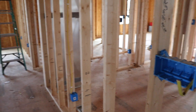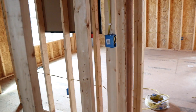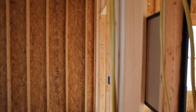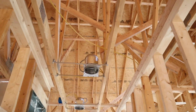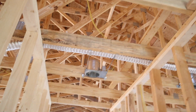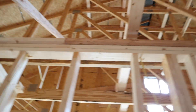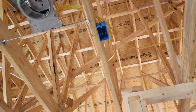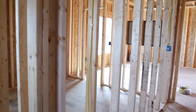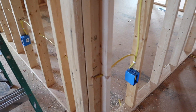I'm going to give you a quick walkthrough of the hallway. I've got a box where the power is coming in, then a 3-wire runs up and over to the other switch, which then goes up to the recessed lighting. It daisy-chains through the lights across the hallway. I also put a box for the smoke detector — it gets 12-3 wire because all the smoke detectors need to be wired together per code. And I've got my hallway outlet hopped off the nearby bedroom. That's all there is to wiring a hallway.